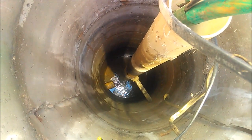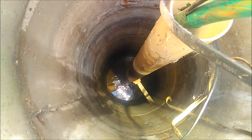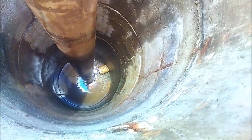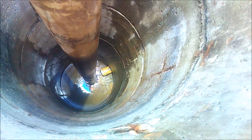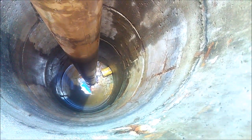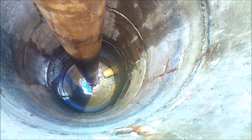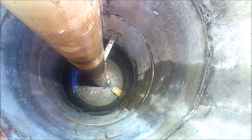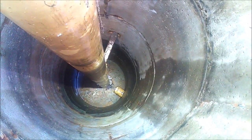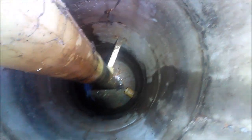We're still pumping out more than what the well is producing. I'm guessing there's about a thousand gallons stored in the gravel around that sideways lateral. It took quite a while for this one to pump down. That's one thing you have to watch when you're test pumping — make sure that the production level has stabilized as well as the production rate. In this case we're going to suck it down enough that we actually get to where we're getting air, and then we can start to establish how much the well itself is making. Everything else that was in there was just storage.